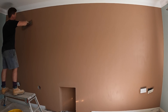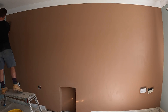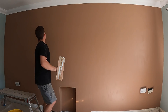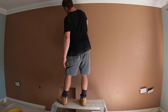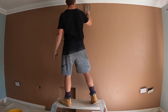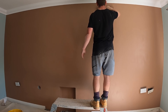Another big tip: troweling both ways. After applying my first and second coat and flattening with the speed skim, I always trowel both ways. If you're troweling both ways you're not only getting the wall flat vertically but also horizontally — you're crossing over yourself and scrutinizing the plaster you've put on. It just means you're getting flatter walls and a better all-round finish. Don't just trowel one way — trowel up and also across, which ensures your wall gets flatter and flatter.